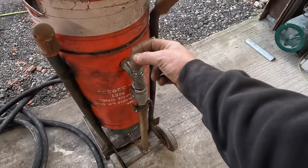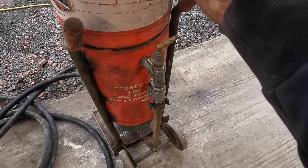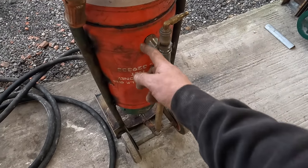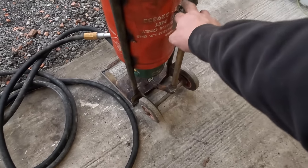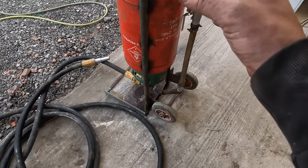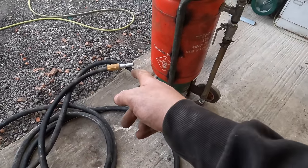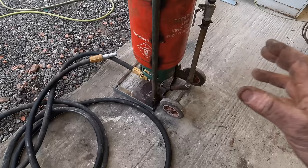It's only to pull a magnet motor in, just to pull the valve out, because it's under spring tension. This valve will be naturally closed until you energize it, and then it'll pull the system up so it allows air to flow through. So yeah, all this 3/4 inch stuff is good for about 250 to 260 cfm, depending on how long your pipe is from your compressor, how long this pipe is, and what nozzle you've got. Everything plays a part in that.